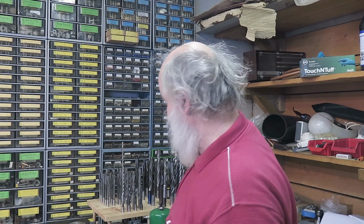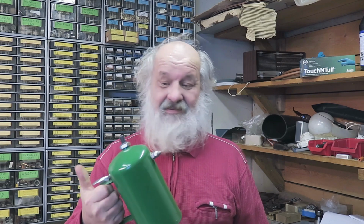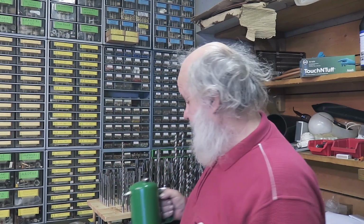And before we can clean it, I noticed that my oil squirter is empty. We need to fill it. You are going to see how I fill it. After all these operations, we can go into making the groove, and this will be somewhat interesting. It's like measuring how to put it into place, because this groove should be quite tight. It should be a sliding fit, but there shouldn't be too much play in that one. So, let's first fill in the squirter.